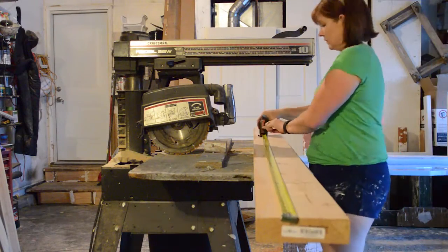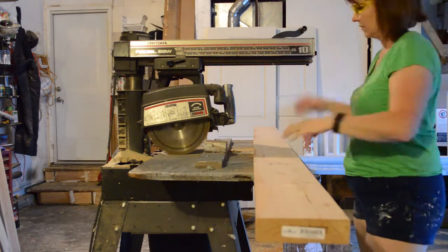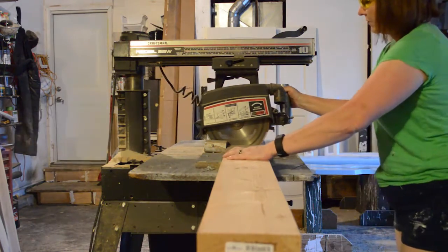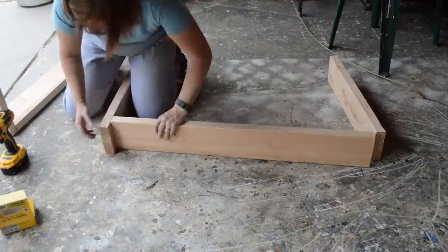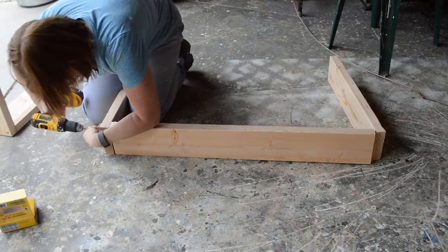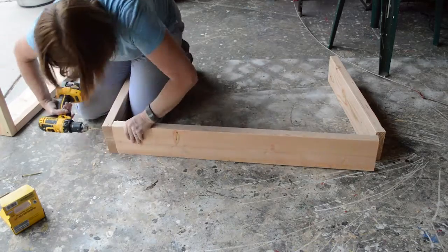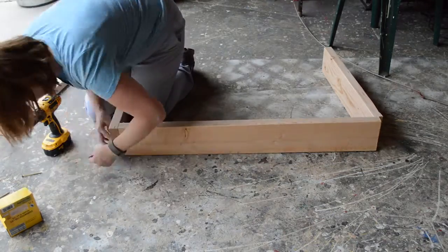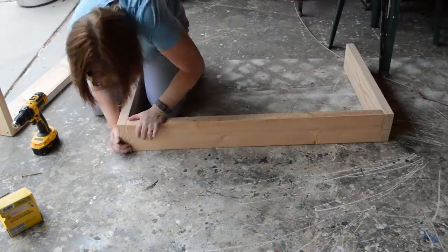To start, this is the bottom — it's a two by six piece of lumber and I'm going to cut it in half so that it'll be 48 inches. This whole piece of lumber will be the base of the brush box. Then what I did was I cut another two by six 24 inches long and those are on the sides, and then I'm just attaching them to the base of the brush box, which is the 48-inch piece of two by six.